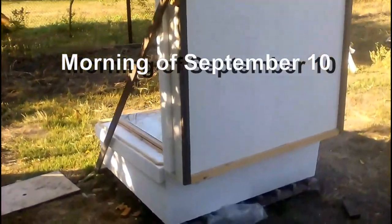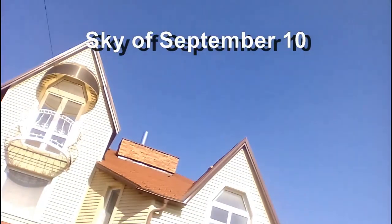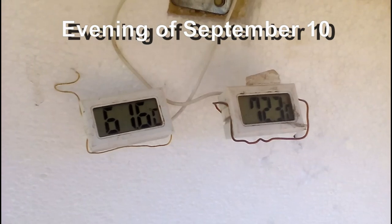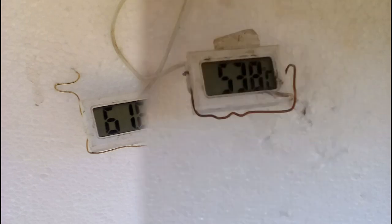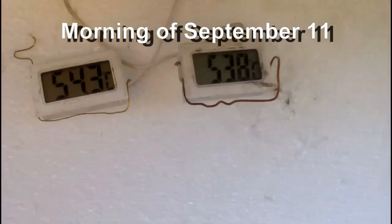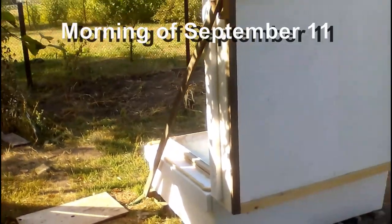I did not close this cover at night, and this is the temperature of those 100 liters the next morning. I will show the evening and morning temperatures for the next days when I did not close the cover, and I did not take heat from the solar heater for the shower and other purposes. The thickness of the thermal insulation of the bottom and walls is 16 cm, and it is obvious that the morning and evening water temperatures will be different if we change the thickness or the number of those sheets of glass and cellular polycarbonate. The height of the water inside the heater is 15 cm.